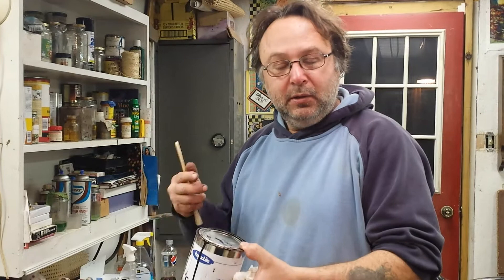You want to shake this up really good and stain your table with it. This is a reddish color stain. Depending on how red your table is, if it seems pretty red you can kind of wipe a lot of the stain back off. Strip the table, sand it, then stain it. Get like a two-inch chip brush — after you stain the table you can kind of brush it back out.